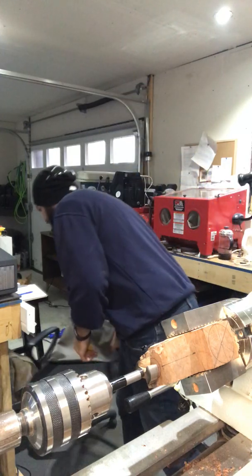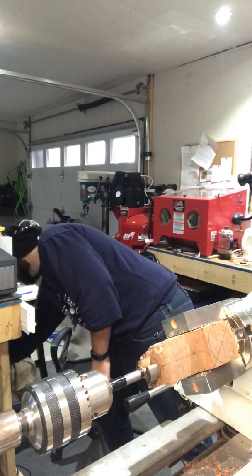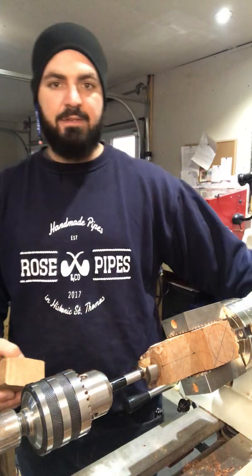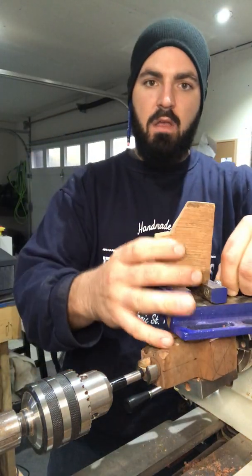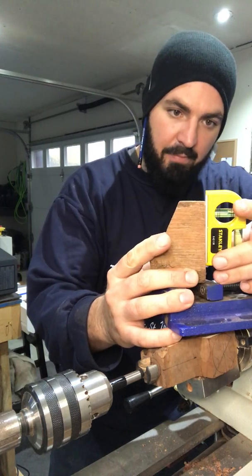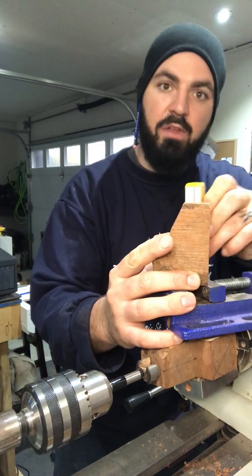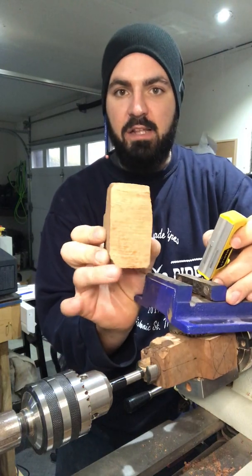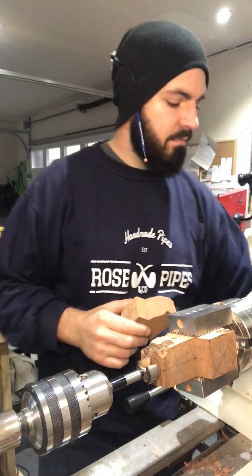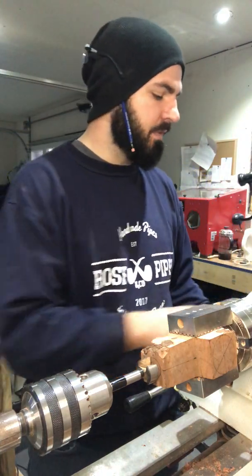So what you're gonna do is you're gonna level, and what you wanna make sure is your shank, when it's in your vise, is 90 degrees. You wanna make sure it's 90. That way the bevel is right in the middle, and you're on the other side. That way you know it's not leaning any which way and it's totally parallel. Levels don't lie for the most part.